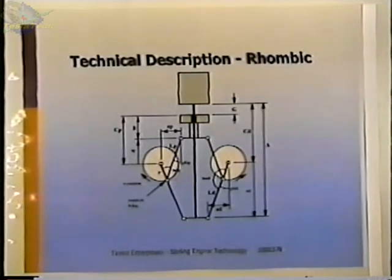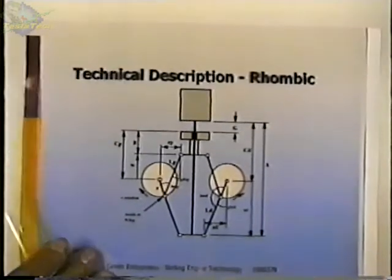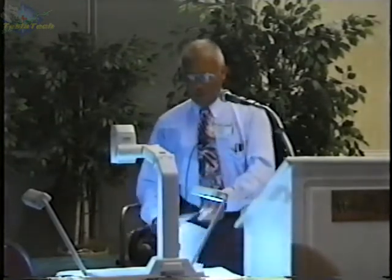The phase difference on my engine is approximately 120 degrees, not 90 degrees. The theoretical ideal is 90 degrees, and there are various reasons why sometimes you don't use that. This is not intentional here. I haven't done a study to try and optimize the phase angle here. It's just that some engines, I think it's due to gas flow, and the time that it takes for gas to flow from the hot end to the cold end through the regenerator has to be accounted for somewhere, whereas in the ideal engine it's assumed to be instantaneous. It isn't, and I think that's why some of these phase relationships stray from 90 degrees. And that's a whole other area of study to just figure out why that is.